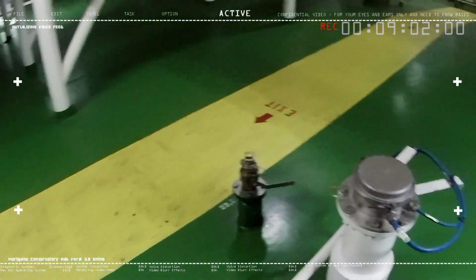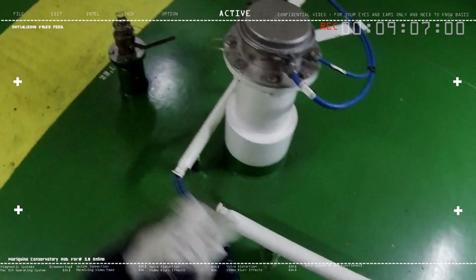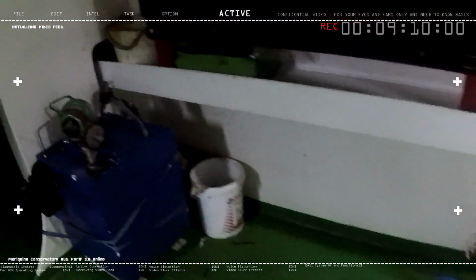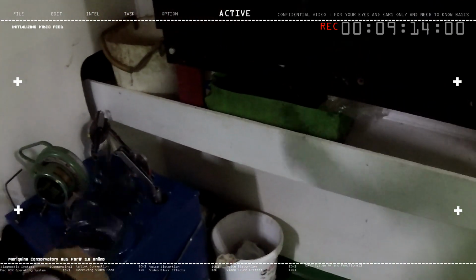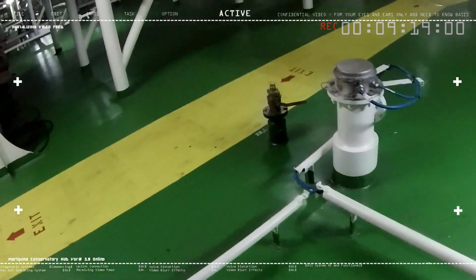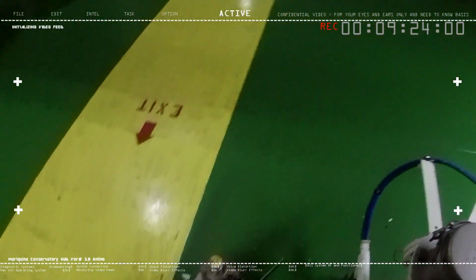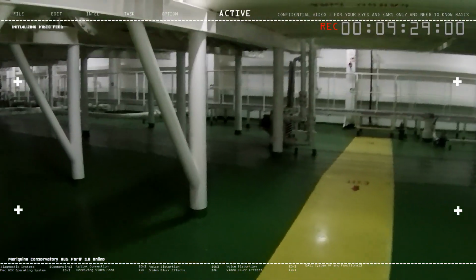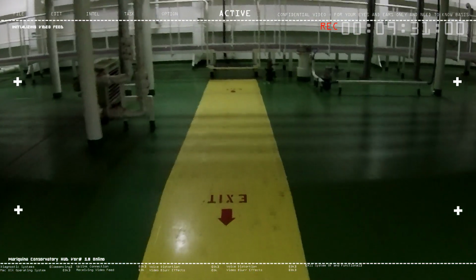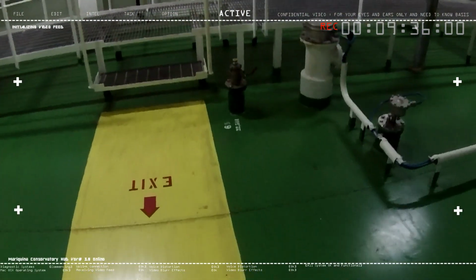And at the same time, our ship is gas free. Probably it's just residue left from the crude oil wash that this ship made a few weeks ago. So it's 1 centimeter. That's the part where you radio that the contents of this sounding pipe is 1 centimeter. Of course, you have to wait for your officer to tell you on which sounding pipe you have to lower the dipstick.